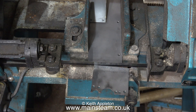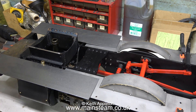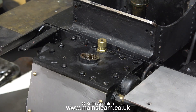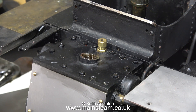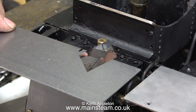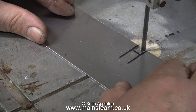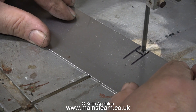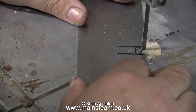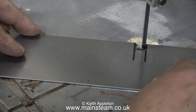Although I'm only showing cutting one side, I cut both sides on the band saw. As you can see from this clip, both of the running boards are now shorter. The next part of the job is quite fiddly. By a process of measuring and comparing and measuring again, with a bit of luck I should be able to make a front extension to the running board at this side that clears both the snifting valve and the main steam inlet. This is very thin steel, so I didn't want to risk damaging it by putting it in the milling machine.